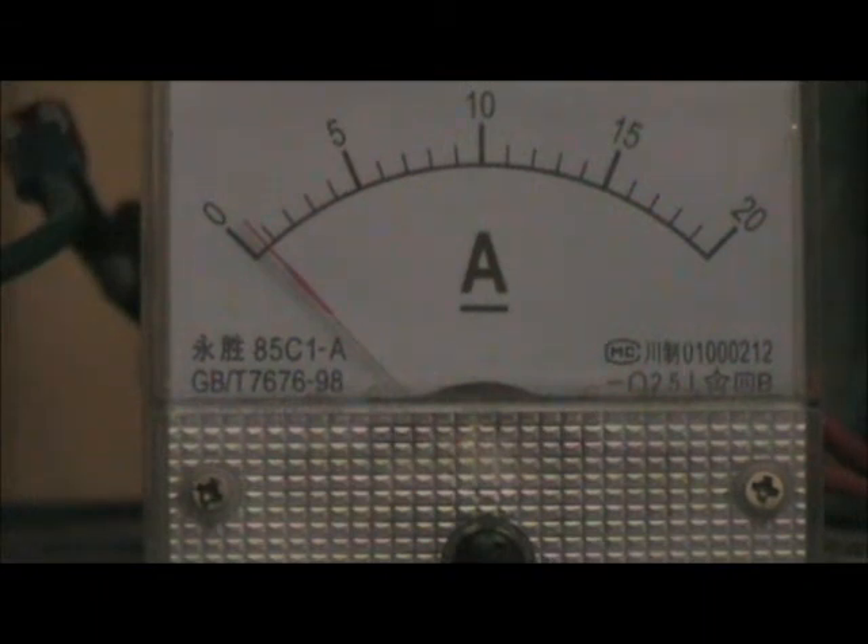When I connect the wire with the aluminium plate connected to it, the light's slightly brighter because there's a capacitance attached to the end of it, so it increases slightly more. If you didn't look very closely you wouldn't see the increase. With just a few LEDs you definitely would not see it unless you had an accurate milliamp meter. I'm measuring the DC current drawn from the battery, with a very large amount of smoothing capacitors — two sets of capacitors — between the battery and the circuit.